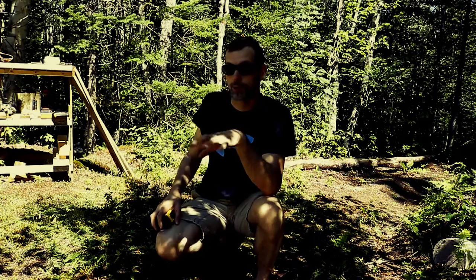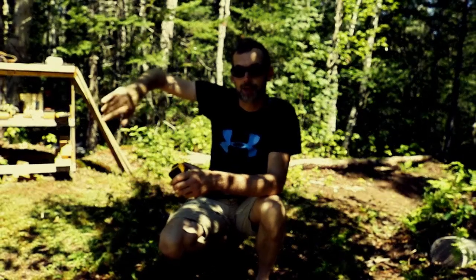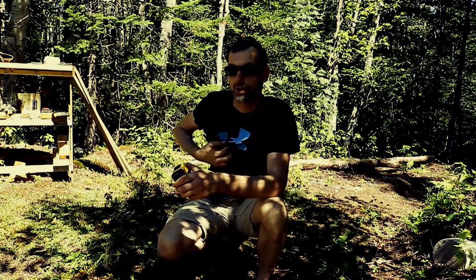And raise it up. So what you can do when you do that is, say this one is 6 inches lower than this one, you just cut a post 6 inches higher. So you start at a point that looks relatively level, and then you just match the post with the corner to make it level. But what I will do is dig it down enough to try and make the cinder blocks as visually level as possible, so that differential is very small. I'm not going to raise it up that much. I feel like I only want about a foot of clearance, so that if I had to get underneath it to scrounge around or something, then I could, but I don't really want to dig a basement, so to speak. So that's the plan.